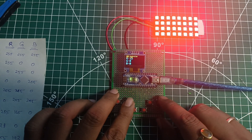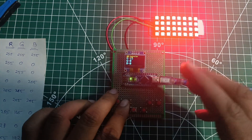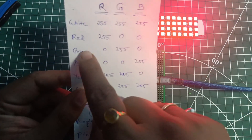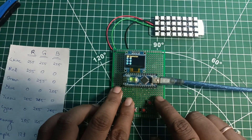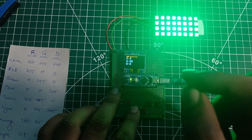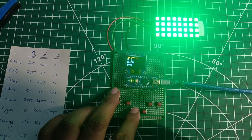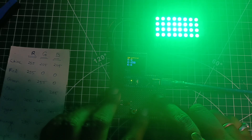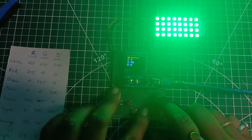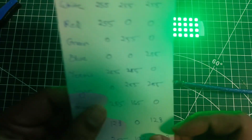Keeping R at 15 with green and blue at zero, you can clearly see the LED matrix glowing red. We achieved the red color. Now for green — we have to put red to zero, green to max, and blue to zero. Making red to zero and blue to zero, then increasing green a little bit, we already achieve the green color. Since red and blue are at zero, increasing green gives us a light green color. We can max the value to increase the brightness, though it gets hard to see on camera. Let me decrease the green value a bit so you can see it clearly — our LEDs are glowing green.